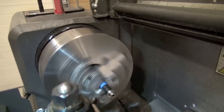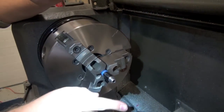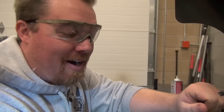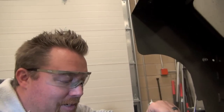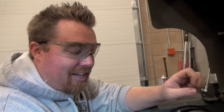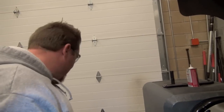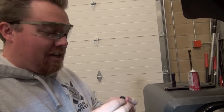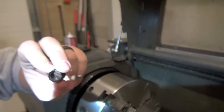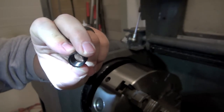That way, a lot of other places, if you see a manual machine, they'll come in here with a tool a little bigger than this, and they'll go in the depth of the cut, and their machine will actually start here and cut from here out. Or they have to cut in. You don't get quite as close of a cut on the threads, as far as getting close to the shoulder, as you do with a CNC. And you can see Silencer Co., they do a really good job on keeping their thread specs pretty tight. You can see the O-ring really in there.